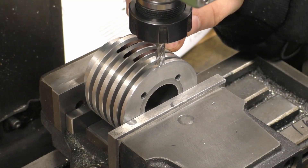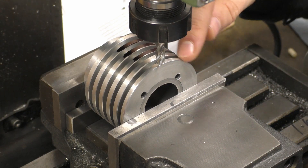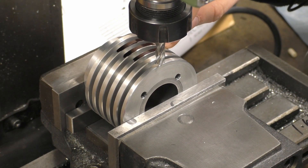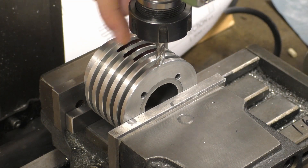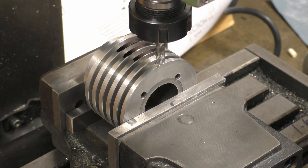We'll come across the 10, then the 3.5, which is the width of the tool — because it's a 7mm end mill, so that's 13.5mm down. Then we'll basically find the centre of that, we'll have the centre on the dial, come down 10mm, and then we'll just start cutting from there.